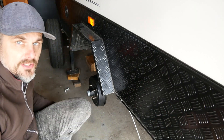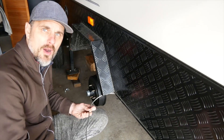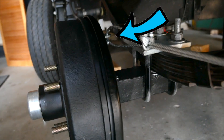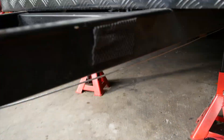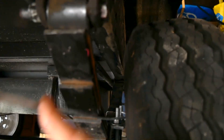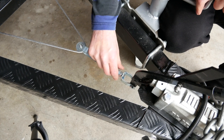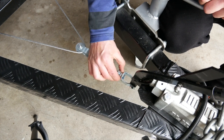I worked out that once I'd installed the hubs and had the brake levers on the bottom, the wire was hanging too low and I didn't like that. So I ended up swapping the hubs so that the lever is on the top. I've also installed a couple of hooks from a spare chain through which I'm feeding the wire, to guide it and keep it away from any other components, wheels, or suspension. Once you feed the brake wire through this loop, you can adjust the tension by rotating this threaded pin — you'll need to loosen these nuts first, and once you get the desired tension, tighten the bolts.